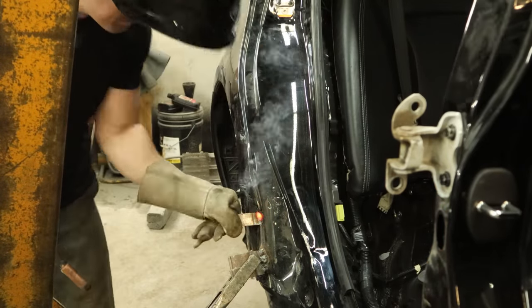We need to cut this tab off — it's folded over to the other side and welded all the way through, so we'll cut the top of it and then grind the back side, that way we won't have a hole drilled all the way through. A few more spot welds and that looks like about as far as we're going to go. I laid out a piece of masking tape to get a somewhat straight cut and we're just going to cut along the top of it. It's basically an arbitrary space — I try to pick the thinnest area so there's the least amount of Bondo, because when you butt the seams together you're always going to have a little Bondo where that seam is joined.